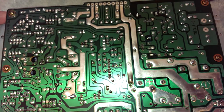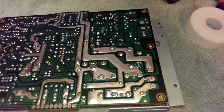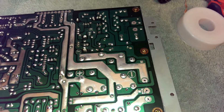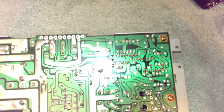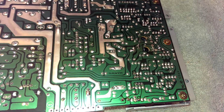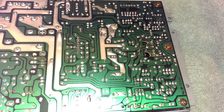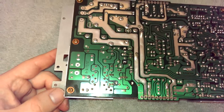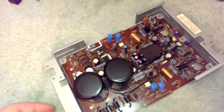You can see a lot of new solder joints. These traces are pretty big — to give you an idea of the current capability, the maximum collector current of the transistors inside the STK module is 15 amps. It is a substantial amplifier. You can see it is made by Sanyo Corporation. As I said earlier, Sanyo owned Fisher at this time, so it is essentially a Sanyo stereo and not a Fisher. It is very Japanese.